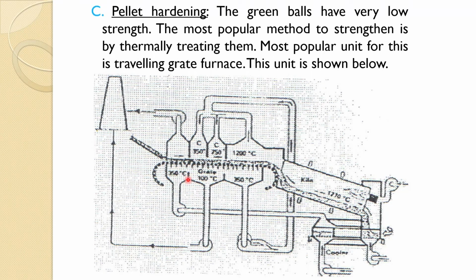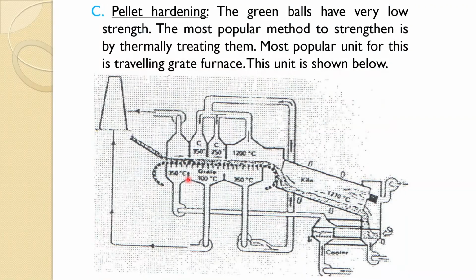In the previous one, it was going to the sintering one. In this one, it is pellet hardening. So, individual pellets usually keep their shape in this case. So, it is not the fusion stage. So, temperature is a little lower in this case. As you will see, this figure shows the